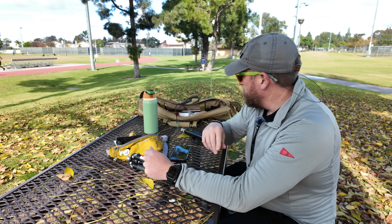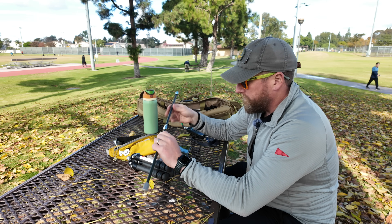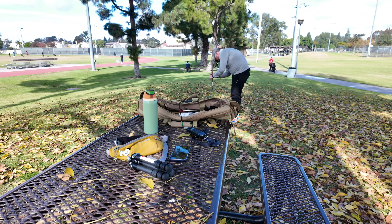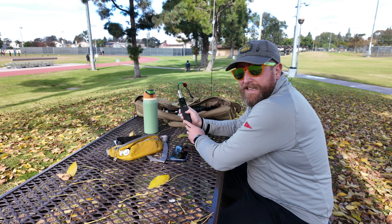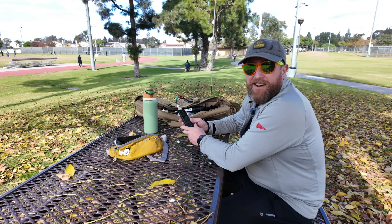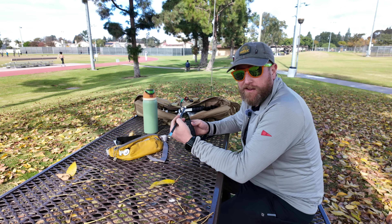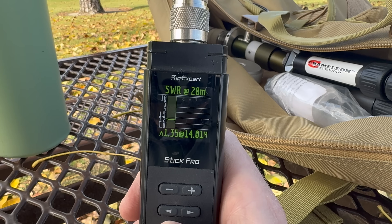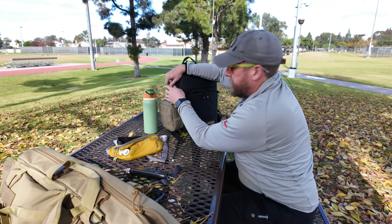Chameleon does have an option as part of their adjustable vertical kit — these rods that you can add — and this will add a bit of length to it. Let's add two of them and see what we get. Sure enough, we made it too long. So let's take out one of those links and check again. One of these on top of the whip is still a little too long, so we're going to physically lower some of the elements until we're right where we want to be. I just eyeballed it, but I got right where I wanted — about six inches off the top.